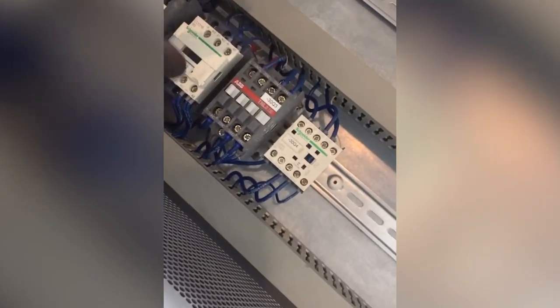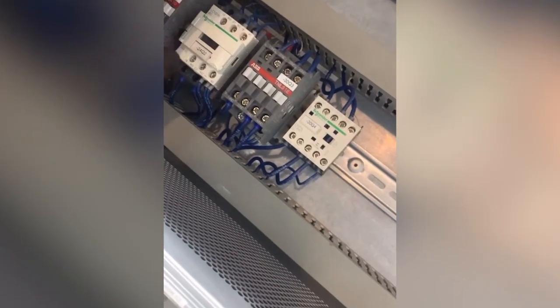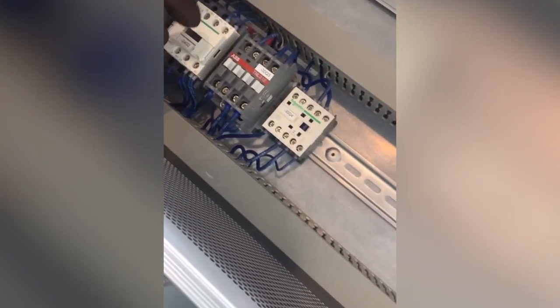The problem here is, I had the loose trunking, which could have been causing a fault. I had a load of gunk in this contactor, which could have been causing a fault. So I'm rectifying things that could be potential issues, but I've never actually really found the issue, the smoking gun. Sometimes you can have faults on faults. The worst kind of faults are faults on faults on faults, because you've got a series of things that are causing faults, and obviously intermittent faults, and this is both.